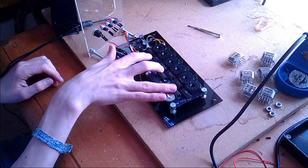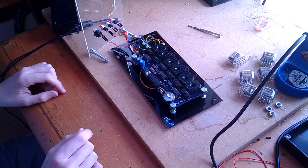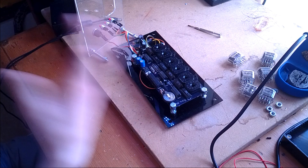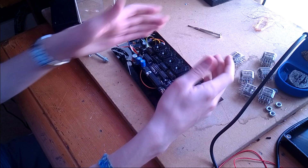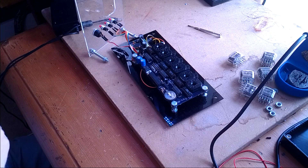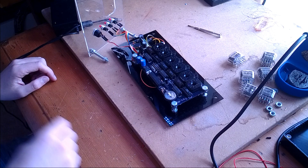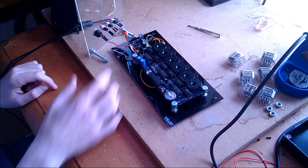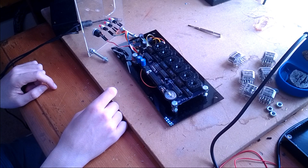This is driving three shift registers — simple 74HC595s which you can daisy-chain. It shifts out to the first one, then the second, then the third. All it has to do is write one 24-bit binary value, and from that I can update all six Nixie tubes simultaneously, then leave them and come back to re-update whenever I want. If I were multiplexing I'd have to constantly update the display, which would make the code much harder. So I've been nice to myself and used six driver chips, three shift registers, and one Arduino Uno clone.